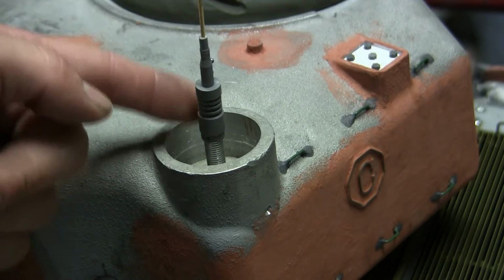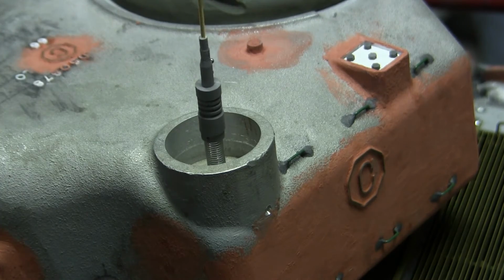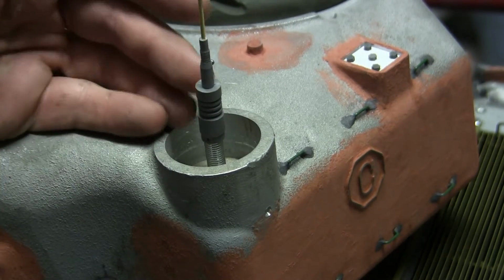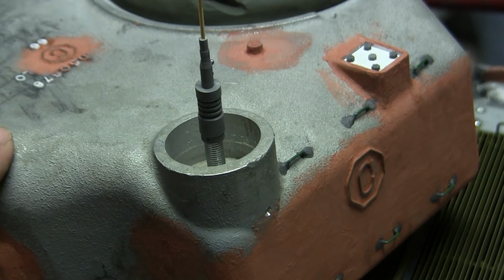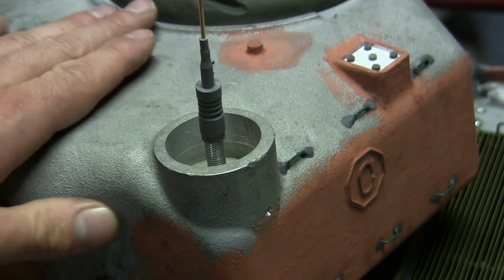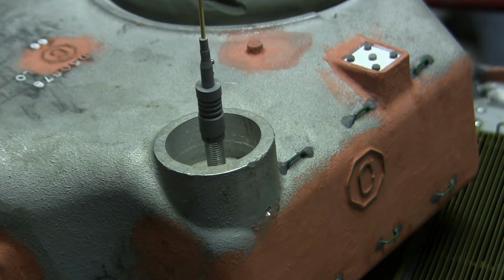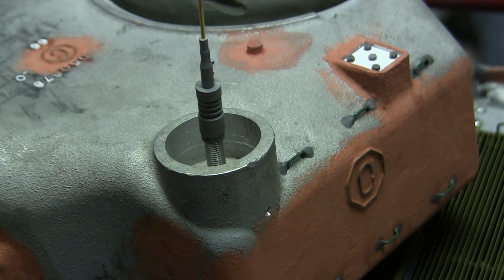As for the antenna itself, this is the standard EastCoastArmory.com static MP48 spring antenna base. Unlike my other radio control builds, in which the antenna base is actually connected to the vehicle's radio antenna and actually extends the radio range of the vehicle. Because this vehicle utilizes a 2 GHz radio, the extended radio procedure was not needed. By doing this, it actually saves an extra umbilical cord that would have to snake its way into the hull from the turret.